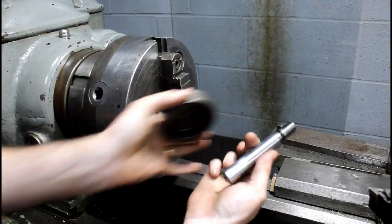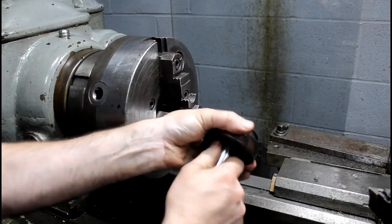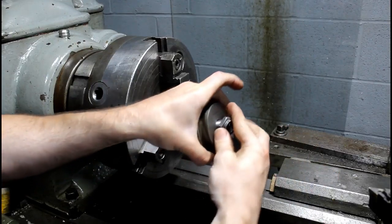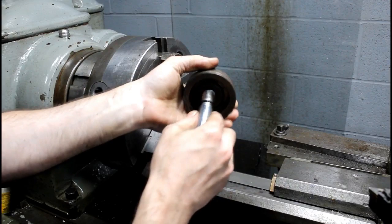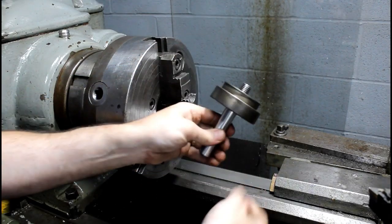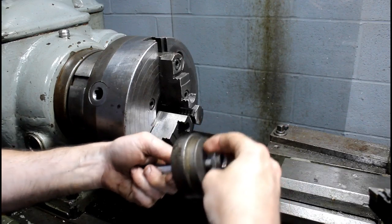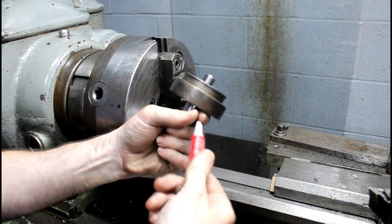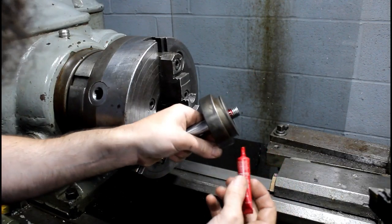Alright, here's the piston, the pusher rod that originally worked in the cylinder and pushed the vise closed, the nut that held it all together, and had an O-ring there to seal the shaft through so you didn't get fluid leakage between the two. Now, to modify this, what I'm going to do first is Loctite this nut on here really good. And I hope this will work.